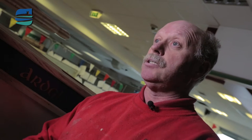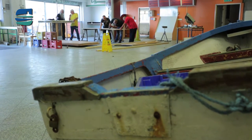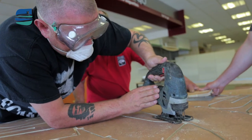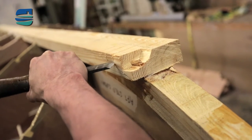Most of the panels are pre-stamped or pre-machined out in the various sheets, and they just basically need some trimming, tidying and cleaning. Then the scarf joints need to be cut for the joints to make them into the full-length planks. We put the frames in, and then after that we scarfed the hog, which goes right along the keel — the bottom keel band of the boat — and proceeded from there.